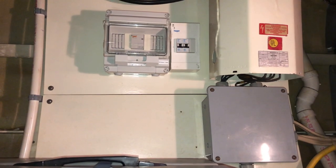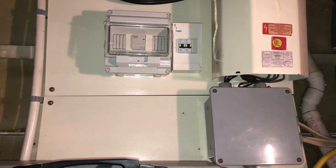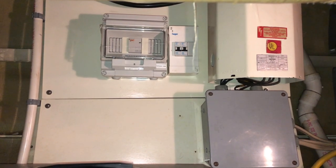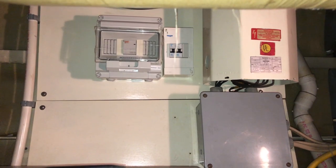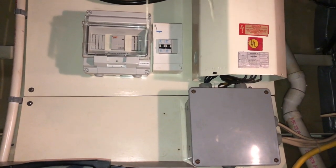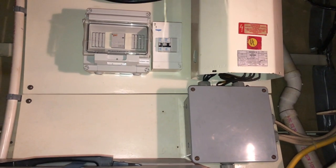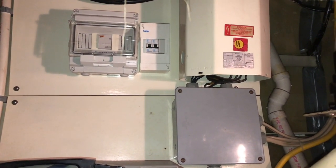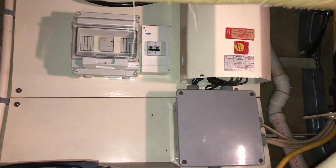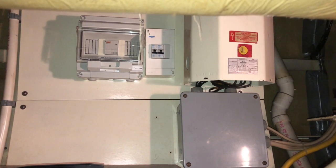We're now looking to port. That's the isolation transformer on the right-hand side upper corner, and on the left there's what's called a soft starter, with a switch next to it — that's for Europe. If you're in Europe and you use an isolation transformer, because of the high inrush current at 220 volts, you'll pop the dock breaker almost every time, particularly if you're set up North American-style. So that solves that problem. It's a Mastervolt product. In the gray box on the lower right are junction boxes or taps, so you can change the taps on the transformer for 220 — when you're in Europe, you can change to 220 and still have 110 on the boat. It's still 50 cycles, so anything with a motor in it can be a problem, but it's fine for charging the batteries.